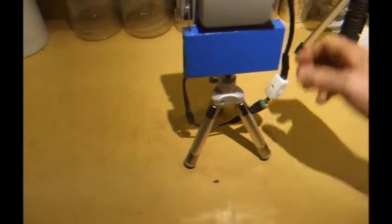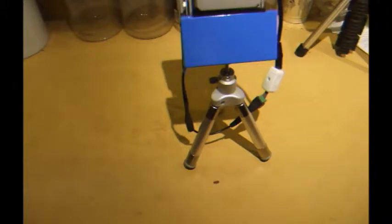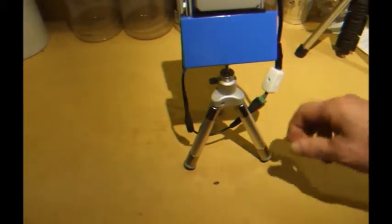So here's the finished solar-powered work light. I used some Velcro tape on the bottom of the lamp housing and the lithium battery pack, and now have a nice portable light. After reworking the LED driver circuit, as shown earlier, I almost doubled the light output of this floodlight. I used a small camera tripod and a quarter-inch nut to attach the lamp bracket to the tripod mounting stud. With the capacity I measured in the battery pack, I should get 5 hours of run time on a charge. It just occurred to me that this video segment is shot totally on solar power — the camera batteries and the battery pack and the lamp were charged today on solar power.